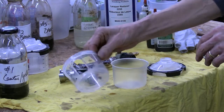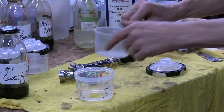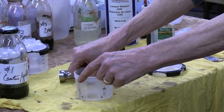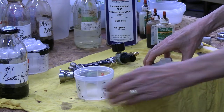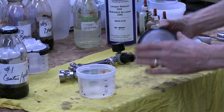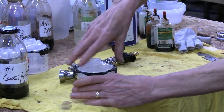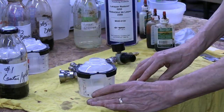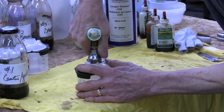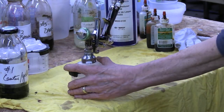The second item is an outer cup — a hard cup that holds the collapsible inner liner. That sits inside the cup, and then you fill it with your finish, or in our case our sunburst, and then you snap down the lid. You turn it to lock it, then push down with the adapter until it clicks, and turn it until it engages.